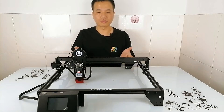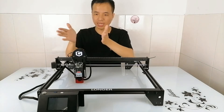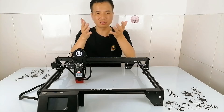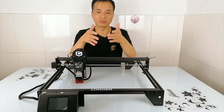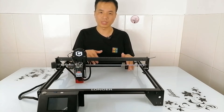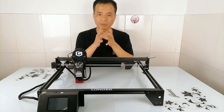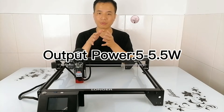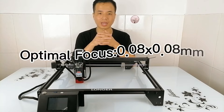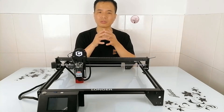Overall, it took me around 45 minutes to assemble this machine. They have a user guide and a tutorial video on their official YouTube, so it's not that difficult to assemble, even if you are a beginner. The Re5 is a bigger engraver machine — it has a 410 x 410 mm work area, maximum output power of 5.5 Watts, and an optimal focus of 0.08 x 0.08 mm, which is good enough for entry level users.